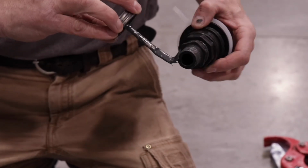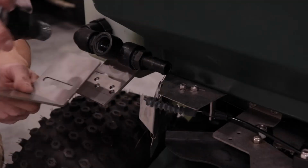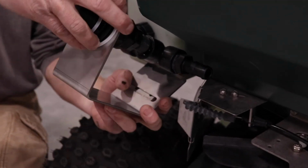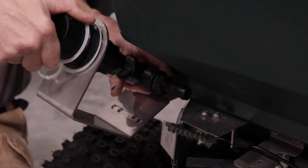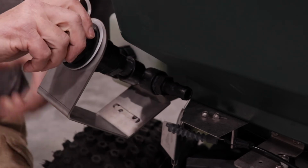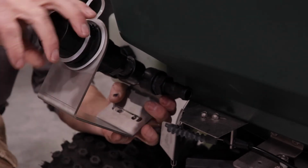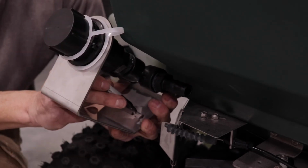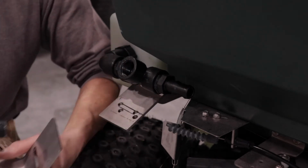Install 3/4-inch by 1-inch reducing nipple into male dry disconnect poppet. Slide poppet through support bracket and temporarily thread into 3/4-inch T. The position of the T outlet may need to be adjusted, with the support bracket held firmly against the shoulder of the poppet and the stainless steel tab on the machine. Mark the slot in the bracket onto the machine. Remove the poppet and the support bracket.